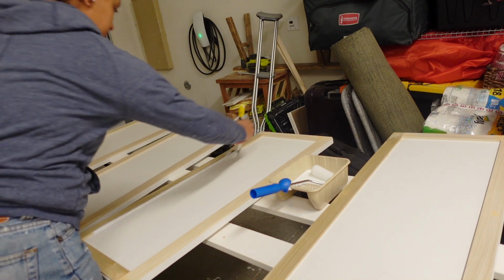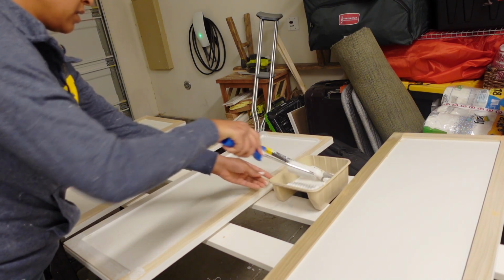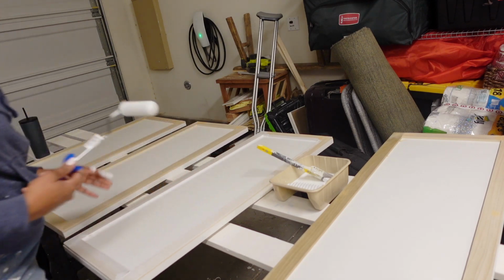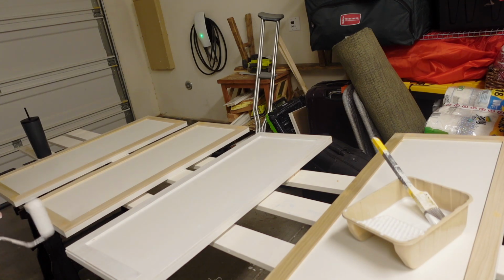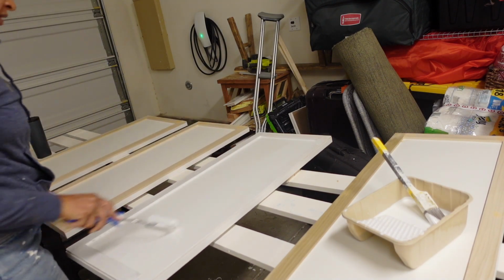And then after that, I go in with Zinsser Bin Primer. This one I believe is water-based, but the shellac base requires no sanding. Just a pro tip there. And I do 1 coat on all of the top, the insides. I cut in with an angled brush, and then I go in with a sponge roller, which gives me the sort of flattish, smoothest finish.